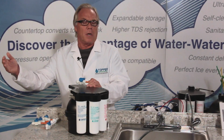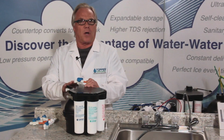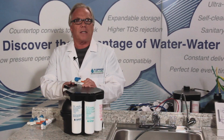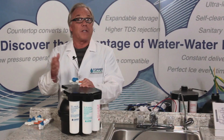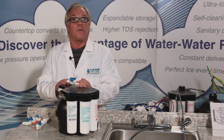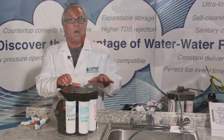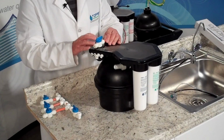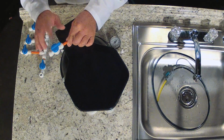That would be at your door dispenser or the ice maker or the cooler or whatever at the time that you finalize your installation. So the system has to have a lot of water in it in order to clear that line. We have one installation, for instance, that we know that it's a 1-inch pipe and it goes out 100 feet. We actually had to put a second set of tanks on the system to clear that entire line to wet the line. We didn't want to do it with tap water. So, in other words, once again, isolation valve.